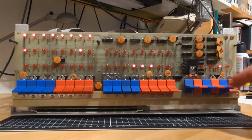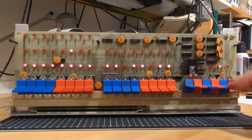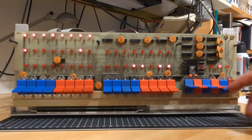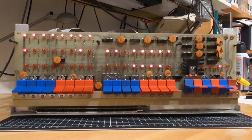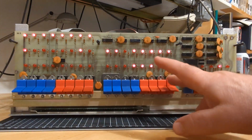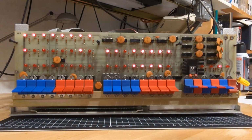We're in a spin loop executing a restart instruction of some kind, which happens to be garbage that was stored in memory, or maybe I stored this in while clowning around by accident. But this gives us a lot of clues. Let's run with these clues, walk through the schematic, see how the CPU and this cable here communicates with the front panel, and see if we can figure out what the heck is going on.